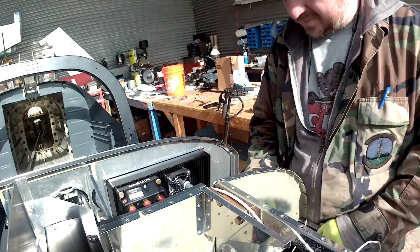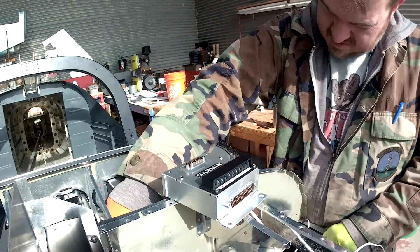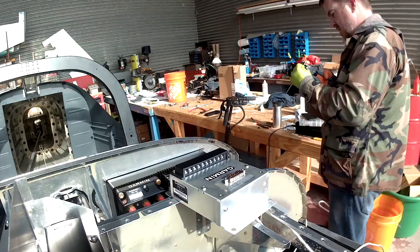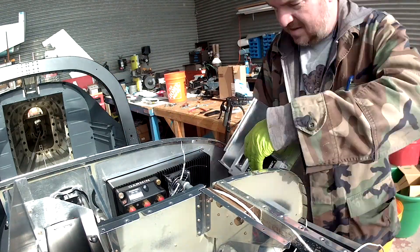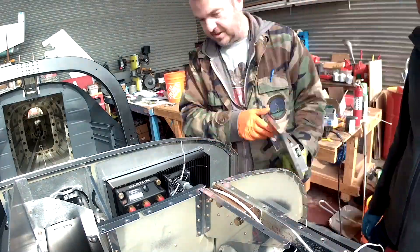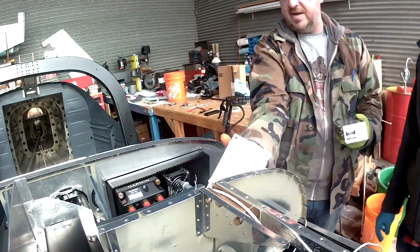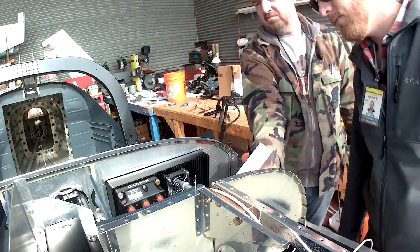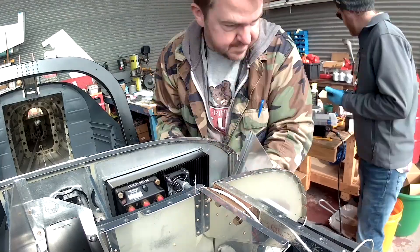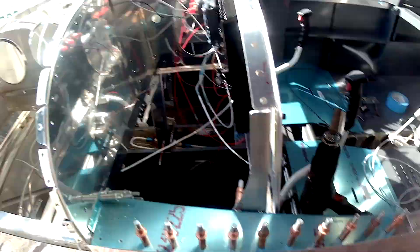What I'm actually doing — there you see it — I am mounting that box. That is the GAD27, the Garmin electronic controller. There are three big pin outputs on it: one's your basic controller and power CAN bus with about 50 hookups — it's one of those 50-pin monsters. There's another small 15-pin one mostly for larger current stuff, like connection to roll servos. And then there's a place where big wires get plugged in — 10 of those — for things like the flap motor.